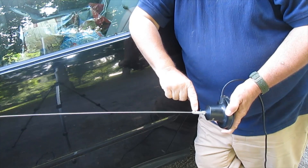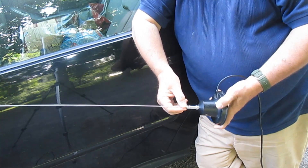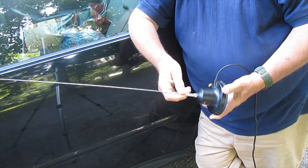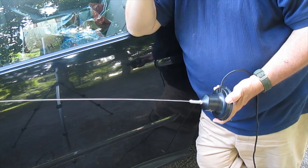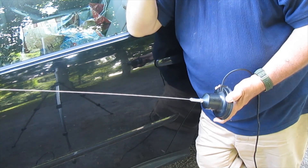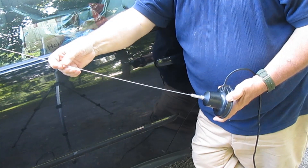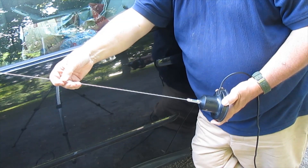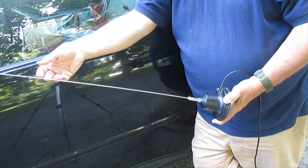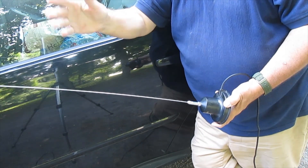So there are some coils in here to make up for that, to match it, but to fine-tune it there's a set screw, and you actually cut this piece of metal to the right frequency. They usually give you a little too much. You do that with an SWR meter, or if you've got the box antenna tuner — we'll go into that another time. But basically, you need to adjust the length of the antenna for the minimum SWR, or standing wave ratio, and you do that by trimming off a little. You keep checking, trim a little, trim a little, until it gets low, and then you stop.